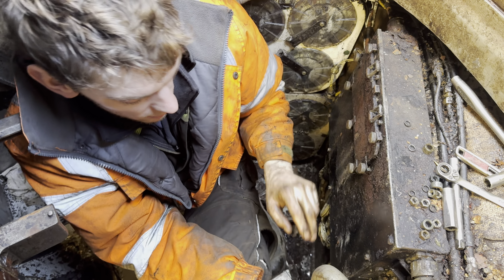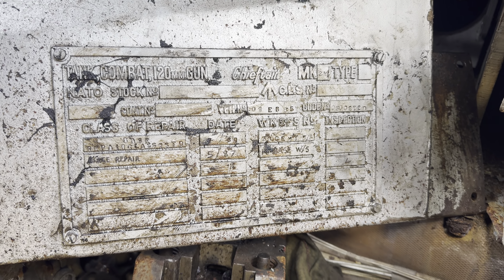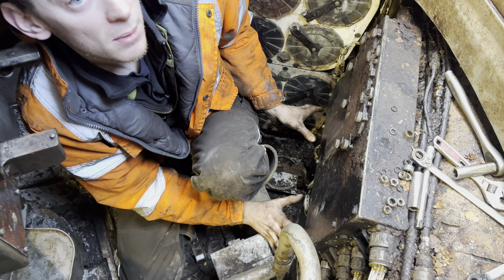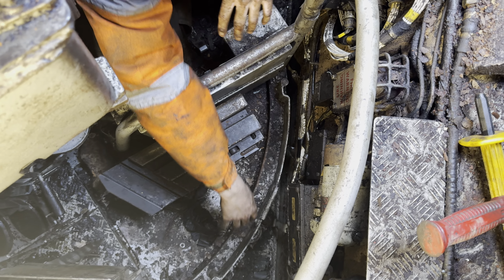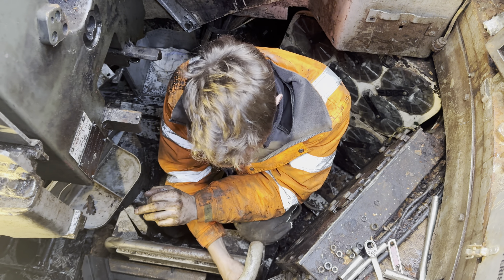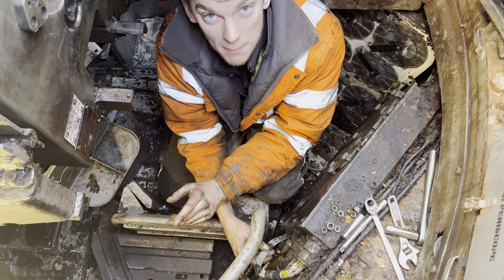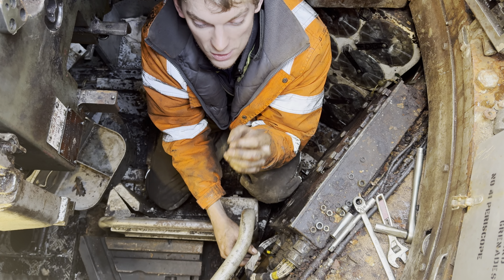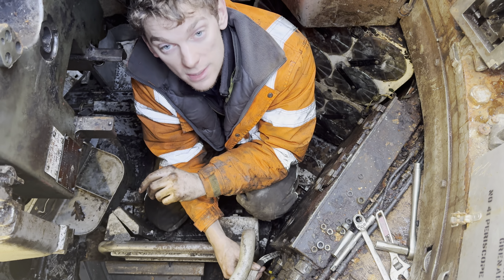I believe we can get it to work, so I'm going to trace this wire back to the engine bay. I've taken all the panel and cowling off. There's a bit of skirting that protects the wires that go to the back from the basket spinning around — that was a real nightmare to get off. There are all these brackets that hold the wires against the hull wall so they don't get caught. We've got all of them off. We're going to get Seb in the back and he's going to tug on the damaged wire that goes to the gearbox control unit — I'm pretty sure it's this wire here — and I do have a spare. We're going to try and replace that cable and then maybe stick some power on it to see what lights up.